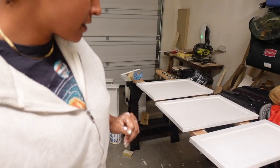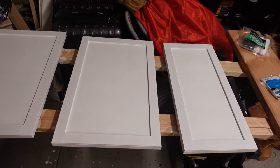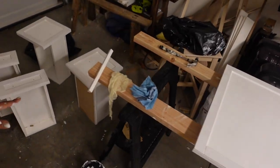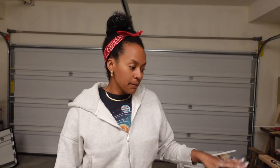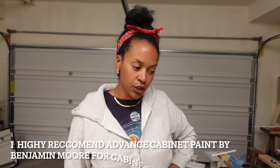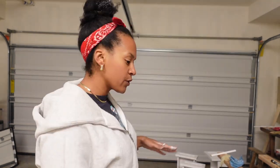As usual, covered in paint — but update: the cabinets are primed and have one coat of paint on them. And these are the drawers — they have one coat of primer on them. I'm going to have to wait 16 hours. I use Advanced Paint by Benjamin Moore; it takes 16 hours to cure. You don't want to rush the process because then the paint isn't as amazing as it could be. So after I get one coat on both the front and the back, I'll have to wait until tomorrow to put the second coat on to be done.